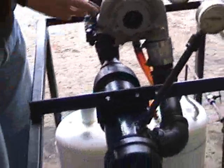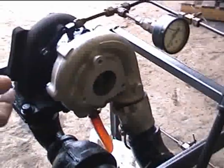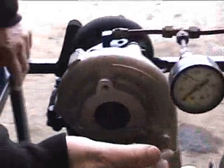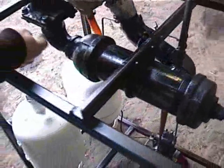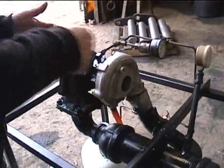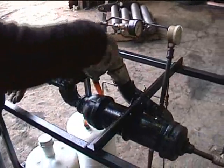One point to remember — a lot of people have trouble figuring out the flows of turbojet engines. It's easy to remember that usually the aluminum-colored side is the cold side of a turbocharger turbojet. This is where the air goes in. It's compressed, comes out this discharge hose here, and goes down this pipe where it enters the combustion chamber, mixes with the fuel, ignites, and expands. It comes out the outlet and into the turbine wheel, and exhausts out here as thrust.